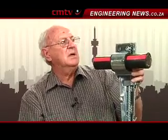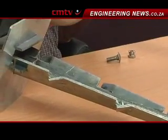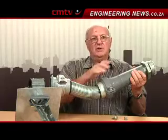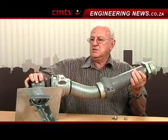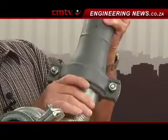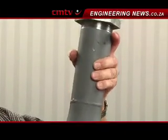The anchors are randomly spaced to suit the site conditions, generally between four and six metres, but that gets assessed according to a risk assessment. Then we have a terminal end unit — that is where the cable enters or exits the trench. It's a system that protects the entire cable, generally the portion which gets exposed above ground level. We have the cable gripping system which attaches to our protector, comes out, and ends up going into your distribution box and being locked with a lock nut.